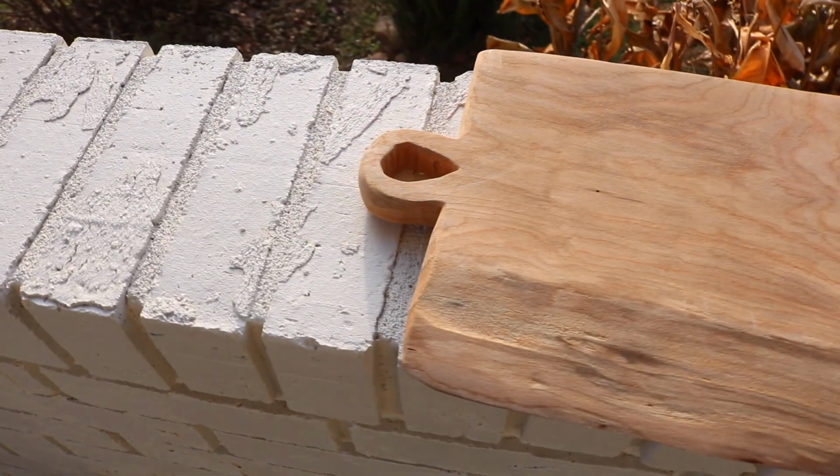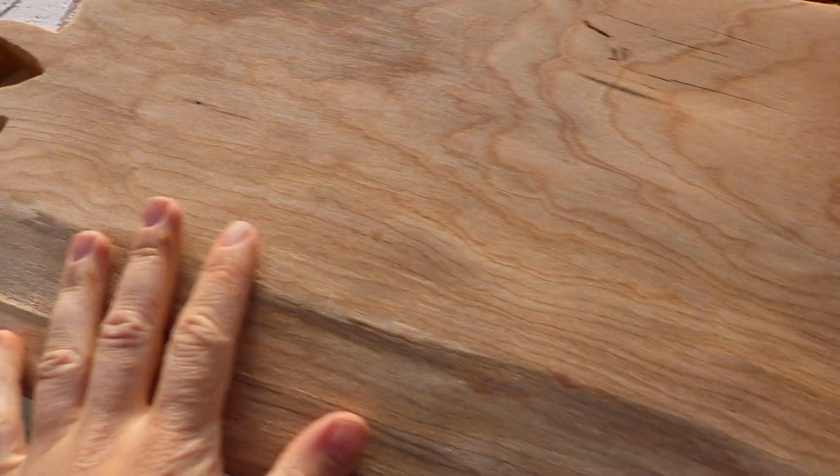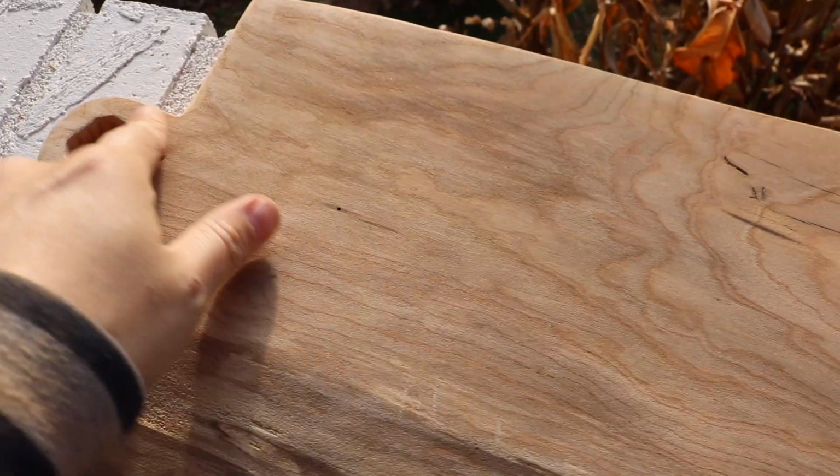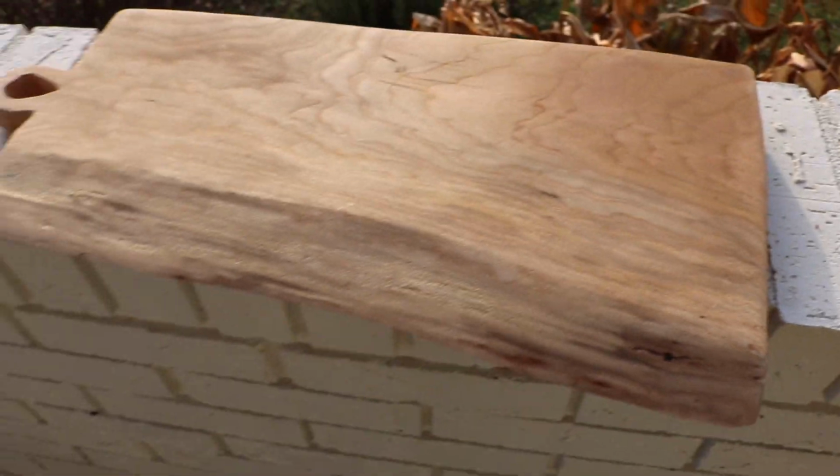Hey, not bad for one afternoon. So finer sandpaper, we're gonna go over it with. Do a little bit more coarse sanding probably around here. And then hemp oil. I should be ready to go. I'm so pleased. Yay. Welcome back to project day number 2.